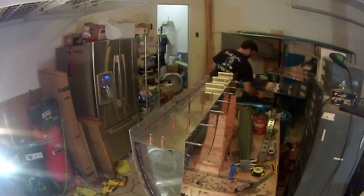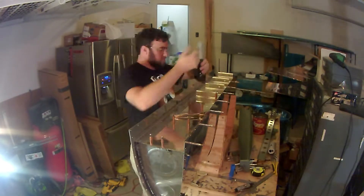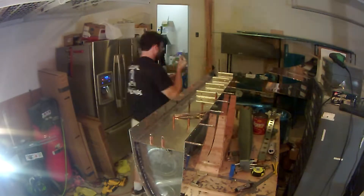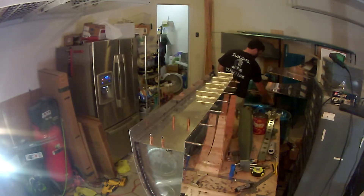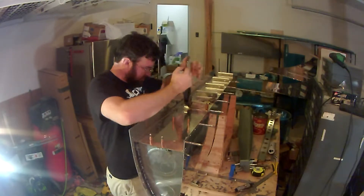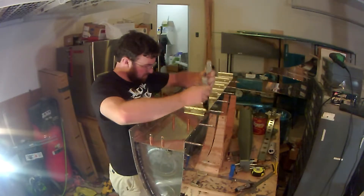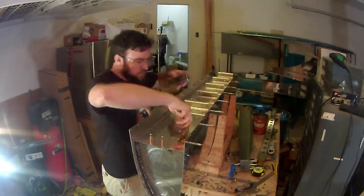This whole process uses special pop rivets — they're sealed pop rivets. It's not your typical pop rivet where it's got an opening and you see the ball that gets pulled into the rivet to squeeze it all together. This one the rivet is solid. Obviously you want to make sure there are no holes for fuel to seep out of, so the actual rivet itself is solid and it just squeezes and encloses everything together.